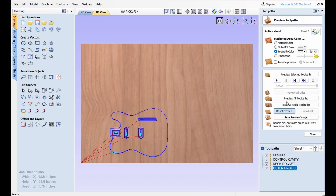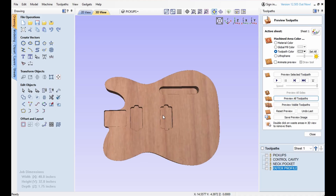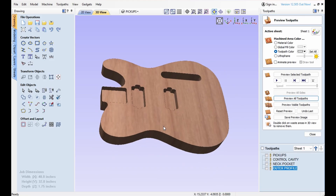Let's take a look at this. We'll reset the preview and preview all the toolpaths. We'll double-click the stuff outside of the body, and since there's no tabs it'll take it away. You can see this stuff here — that's just some glitch in the 3D rendering. Anyhow, this is what the guy wants. I will drill the hole in — that's not shown. The hole from here to here allows you to run a wire, and from here to here allows you to run the wires between there, and the 7/8-inch hole on the outside here. Additionally, the 1/8-inch roundover is not shown, but all that stuff will be in there — those are just secondary ops that I do.